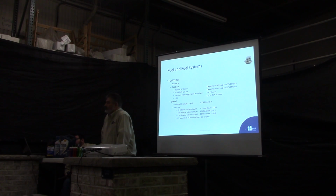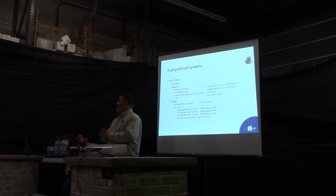On your concrete saws, we've heard both ways: that you should never blow those filters out because you're going to punch holes in them, or you should blow them out, or just replace them new. Is yours a solid compact one, or a fiber, or this pleated style? It's just a pleated, small square one. Yeah. I'd say for us, we blow them out. You can blow them out a couple times, but you've got to make sure you drop your pressure on your regulator for your blow gun. If you use that rubber tip blow gun that OSHA doesn't know about, you can punch out the pleats. If you're at 20 to 30 psi, the chances of blowing those pleats out are limited. But then again, if the filter's only $2-3, what's it hurt to keep a couple on hand? Right. So you can go either way.